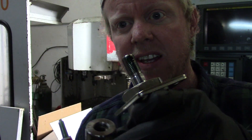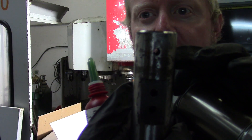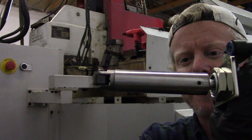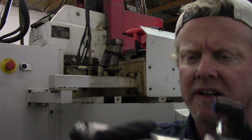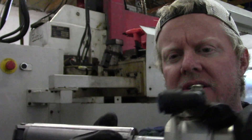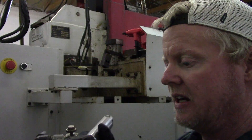I'm going to take this over to the bench real quick. Got a little bit on the threads there. I'm going to screw this in and tighten it down — you can see through it, but it goes all the way through with two set screws per side, one on top of each other. We've got the assembly back together with green Loctite on the threads and set screws back in place. You can see what this does — it basically pops out and hits that carriage. It's a really short stroke cylinder.